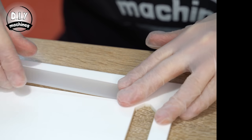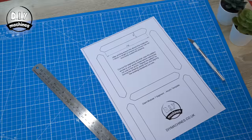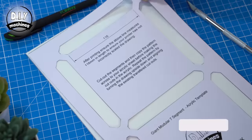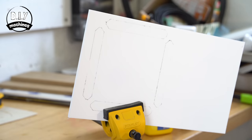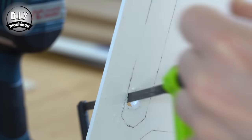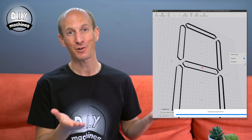For the crisper edges that you saw in the demonstration I took a sheet of opaque acrylic, cut out each of the segments in its front and into these cutouts insert some pieces of translucent frosted acrylic. To make my cutouts I used a Snapmaker desktop CNC machine. You can also make the cutouts by printing the template from my website, transferring the markings to the acrylic sheet, and then using either a small handheld router such as a Dremel tool, or drill a hole and thread a hacksaw through it to make the cutouts by hand. I've also included the DXF drawings for both the cutouts and inlays suitable for a 1.5mm router bit in the download section on my website.